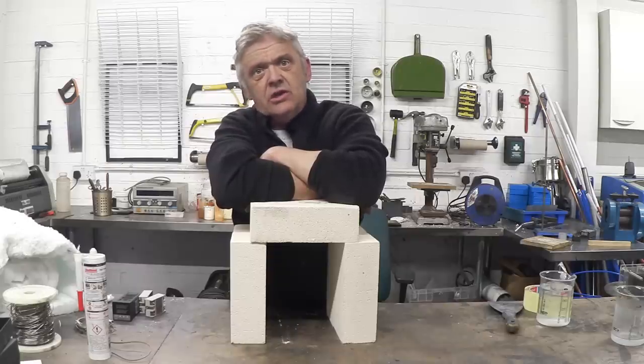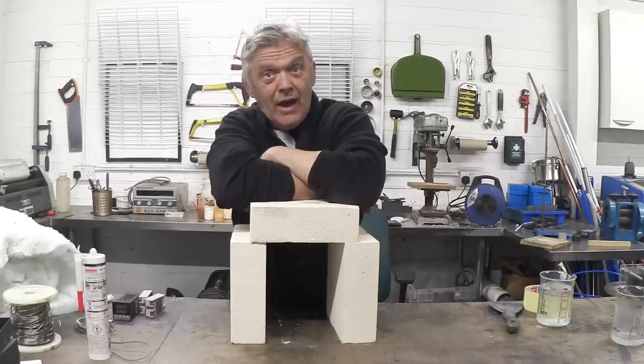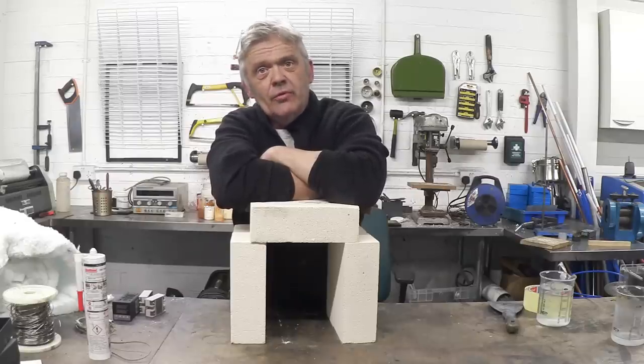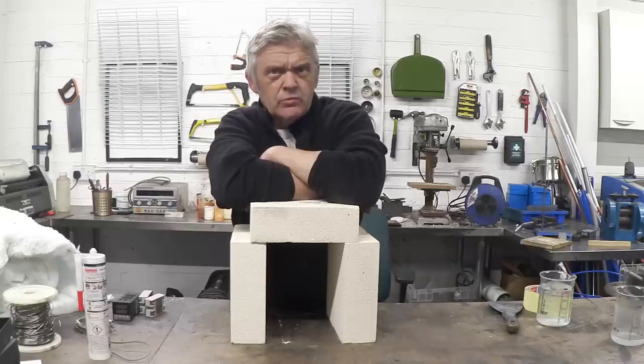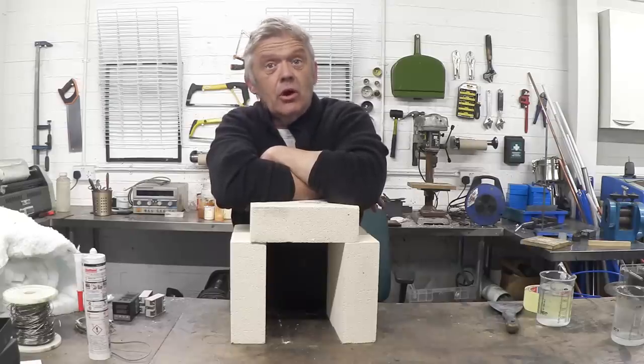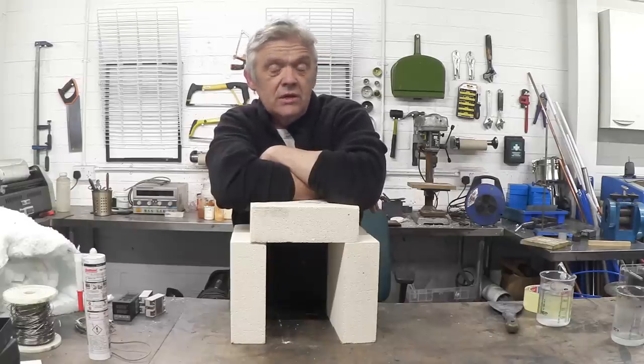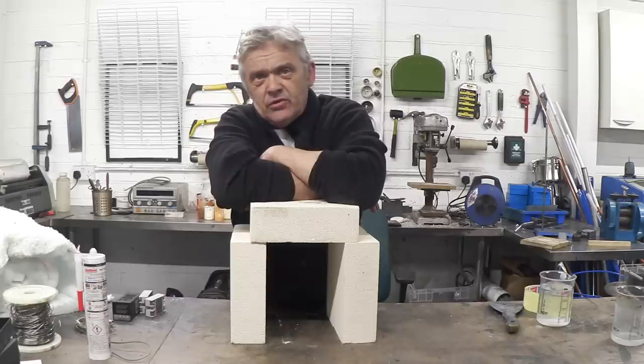This gives us quite a nice kiln structure that's relatively quick to make and dry, and does a really nice job on the insulation. A kiln works by balancing the input heat with the heat lost. You can heat the kiln up slowly if you don't put much heat in, as long as it isn't actually losing that heat — it will get up to temperature. If you want to heat quickly you have to put more heat in but still prevent heat loss, so insulation is one of the prime things about a kiln body.